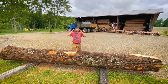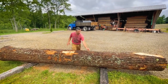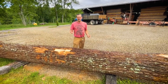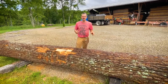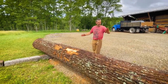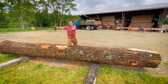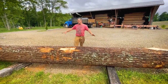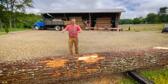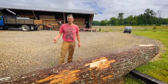I call this my secondary staging. I know, right? How cheesy can you get? But at any rate, wherever you stage your logs, rotate them in a manner in which the small end is towards the head of the mill. You don't have to. You can always just run back and forth measuring a million times, but you know what you got if you do that, and it just makes life a lot easier. So the reason it's pointed the opposite end, maybe some of you tuned into that, is because I'm going to load these timbers or railroad ties up with all the logs that I wash, and then I'm going to bring an excavator over here and snatch this dude up, and hey, what do you know, right? It's pointed in the right direction. So it's kind of a method to the madness.